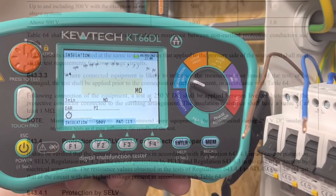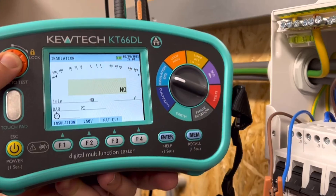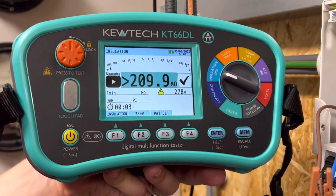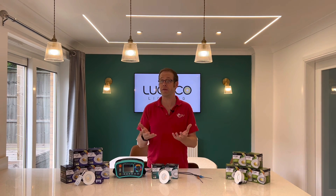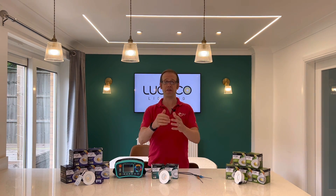So you connect the fittings into the circuit and carry out the test at a reduced DC voltage of 250 volts in order to avoid damaging the sensitive equipment. Now that might all seem like a bit of a faff — installing then removing temporary connections and carrying out repeated tests — and indeed it is, if you don't have a better option. But thankfully you do have a better option.